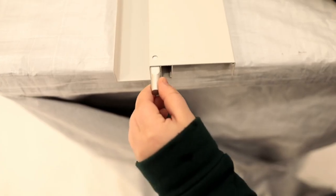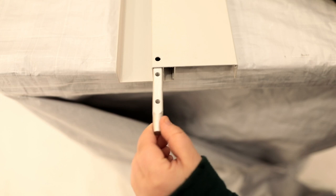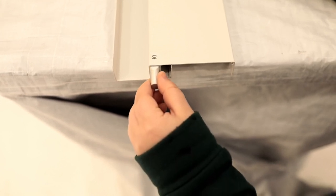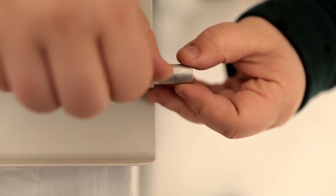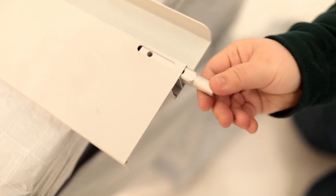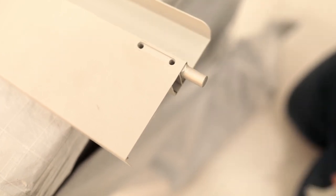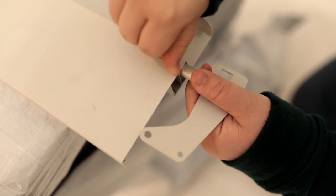In the remaining louvers, insert a standard pin in the square slot on each end. You'll want to install the standard pin so that the end with the holes is inserted into the louver. On the other end of the louver with the single hole, push the pin in so the second hole aligns with the screw hole, then attach with a pan bolt. On the other end of the louver, push the standard pin in so both holes are visible in the slot and loosely attach a pan bolt into the hole closest to the end of the louver.